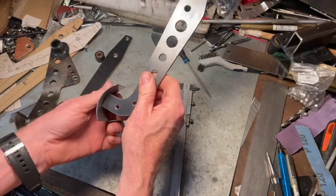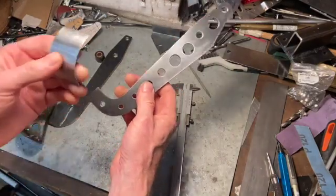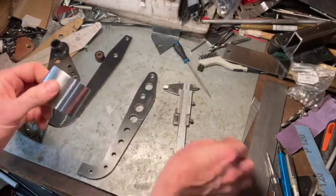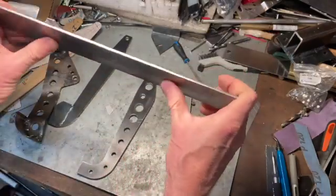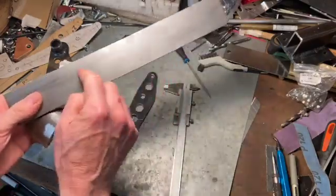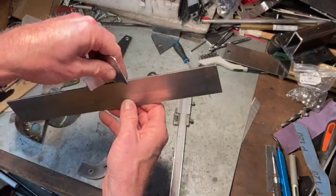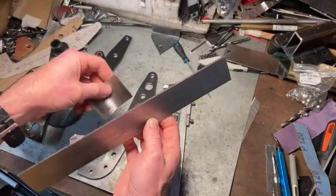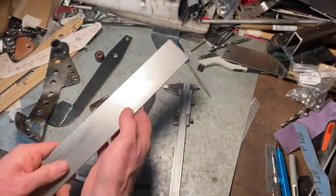I can't help thinking it's a bit spindly — it's only 1.5mm thick. Given that I've made everything else bomb-proof, I want to make that bomb-proof as well. So I'm going to make it out of 3mm plate instead. This is a length of 3mm plate — it's quite hard to bend. I've got some rollers but I think I'll struggle to bend it that way, so I'm going to stick it in the vice, heat it up cherry red with the oxy-acetylene, and bend it — it'll bend like a banana, like chocolate when it's that hot. I need to estimate approximately a one-and-a-half inch radius. Time to bust out the oxy-acetylene and try not to set the garage on fire.